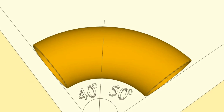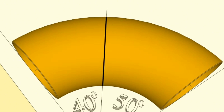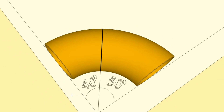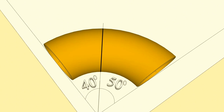Marking is over on the 90 degree elbow; we can remove the spirit level and square right angles. In the next step, we connect the places marked on the 90 degree elbow with a whole line. We check that the straight line drawn on the workbench coincides with the line marked on the 90 degree elbow. As you can see, the marked line on the 90 degree elbow coincides with the common line of the 50 degree and 40 degree angles.